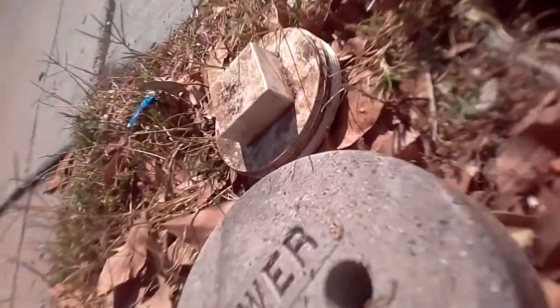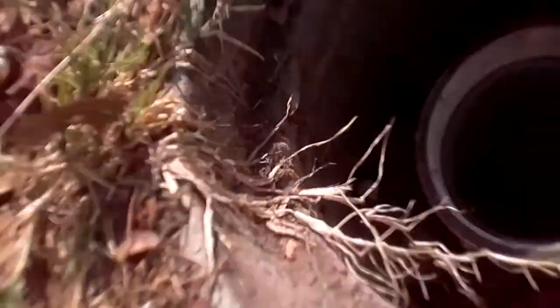So this is where a pan-and-tilt camera comes in — perfect for this purpose. We're going to go down this vertical four-inch green bell PVC pipe. There's a T-junction right there, so that should be headed towards the house. We'll go ahead and go down just a little bit further.